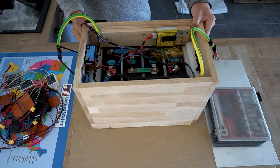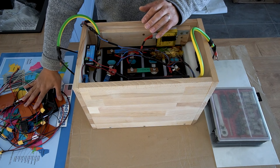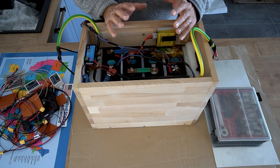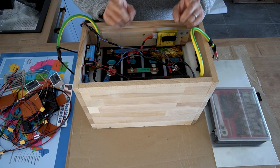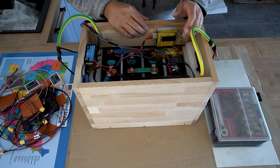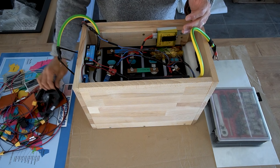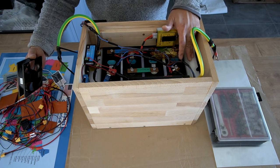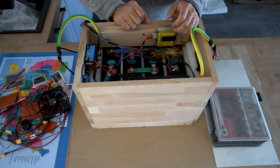I took the battery out of the van. I've got to take all of the parts from the previous video and get them installed into this battery, which requires some new configuration. I'm going to take everything apart and figure out exactly how it goes back in. Most likely I'll have to take out a lot of this foam that I put in here to take up space, because without removing it there won't be enough room for the fan, temperature sensors, or for air to circulate when the fan is installed.